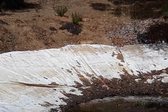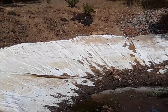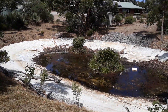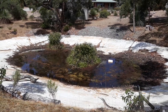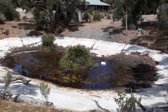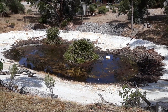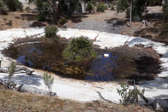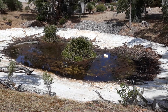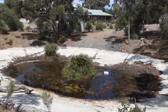Originally years ago I had decided I'd put the pump over there and just run an underground line up to the house to run the sprinklers, but after the first summer we hadn't actually put the pump in place. We realised we lose most of the water out of the dam and anything that's down there is likely to get sucked up into the pump, so we figured we're better off to go to a tank system, which we have got.